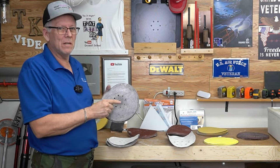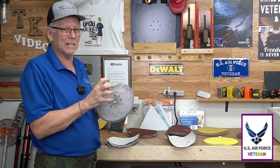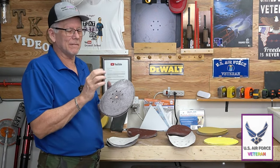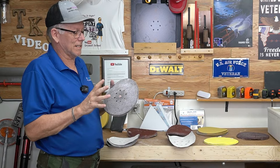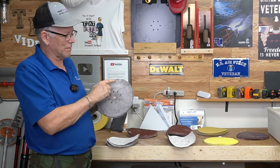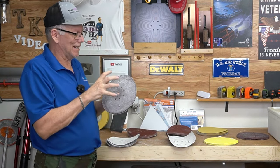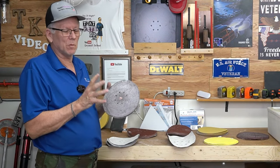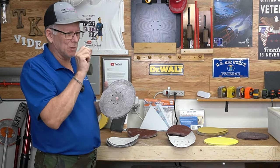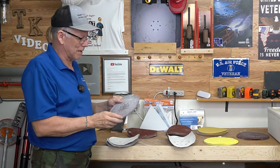So if you scuff sand a painted surface, don't bear down too much. I use 24-grit for sanding off popcorn ceilings and also sometimes after scraping the majority of it off to quickly remove the rest. Anytime I'm going to apply a skim coat over a wall that's been textured and painted, I scuff it with this or at least 80-grit, because you want fairly aggressive scratches in the paint to take off the gloss. Nothing likes to stick to a shiny smooth surface, so we give it 'tooth' for the mud to hang on to, and it won't peel off as easily.